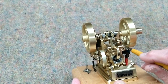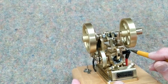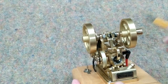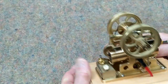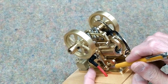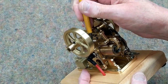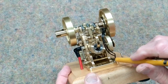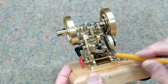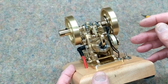The big gear has a cam on it which runs against a roller — this is a rocker that operates the exhaust valve. You want some oil behind these gears and on the gears. There's a clevis on this side and another clevis down here. This pushes up and down and works this rocker, which in turn opens the exhaust valve, right behind this exhaust pipe. The exhaust pipe comes off of the manifold for the exhaust valve.